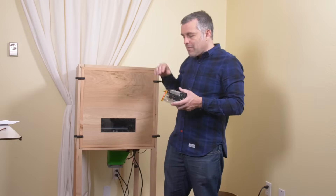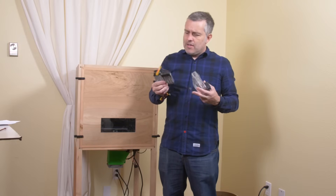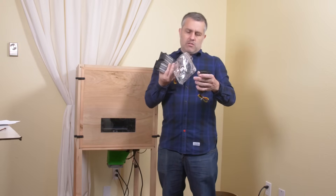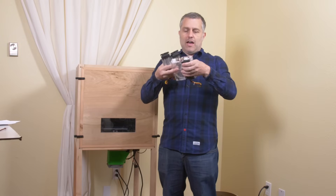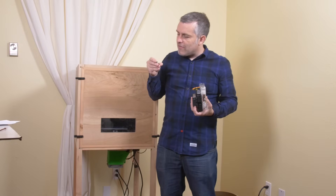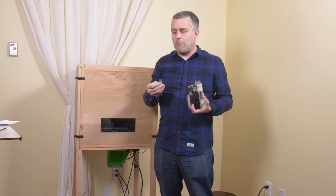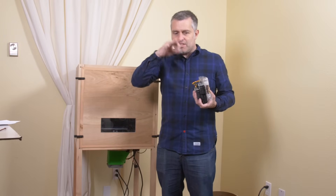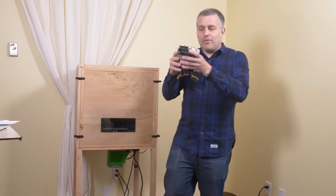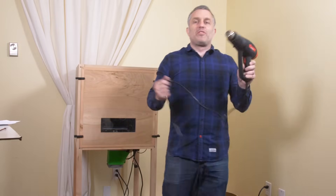When I first thought about this project I bought three AC 220-volt heater cores and planned to put a 120mm fan blowing across them, using an LC25 Arduino PCB to somehow get Marlin to work as a chamber heater brain. It was rather convoluted. But there's a much easier way: this Harbor Freight heat gun — basically a glorified hair dryer. Don't use it as a hair dryer, it'll set your skin on fire. It's got two settings: hot with high fan, and kind of hot with lower fan.